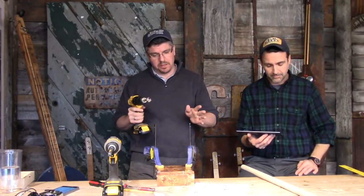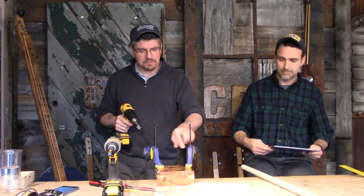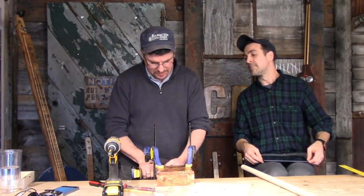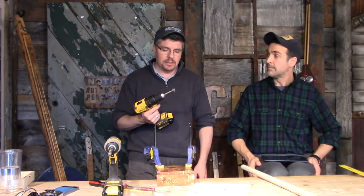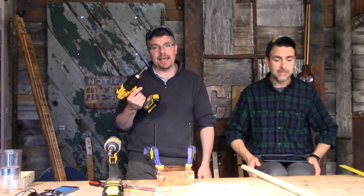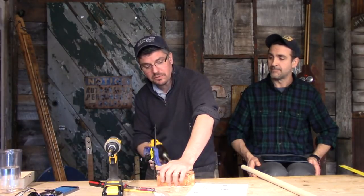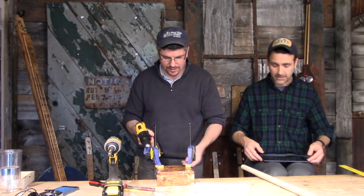You're not going to be able to really see me drilling the hole because I've clamped this box to my tabletop with two clamps to hold it in place. Because when you're using a Forstner bit, they're really designed more for drill presses, in my opinion. Using it in a handheld, like if I was trying to hold this box and use this Forstner bit and I slipped, oh, not good. I've seen it happen. I'd be a pile of hamburger on the bench.